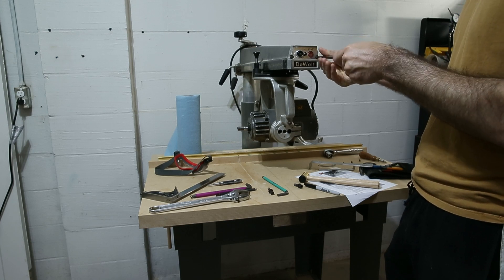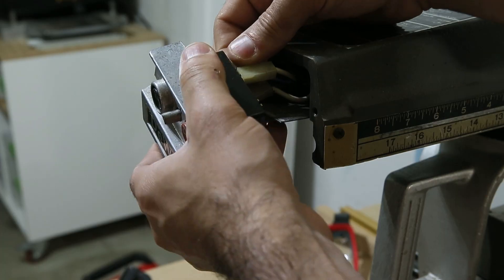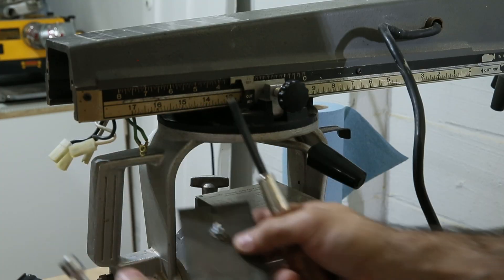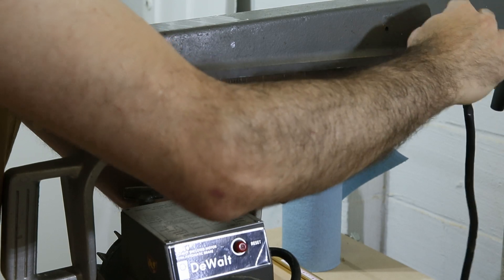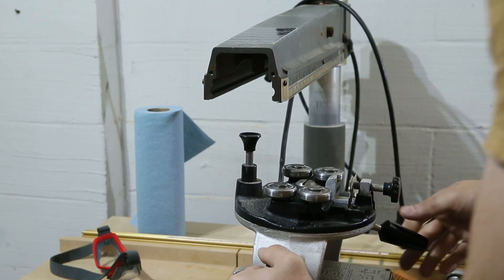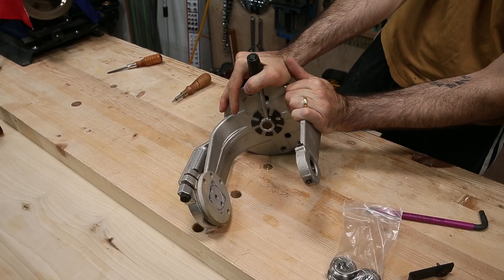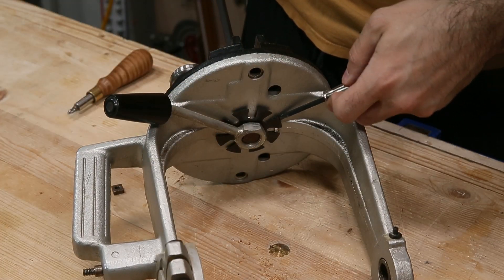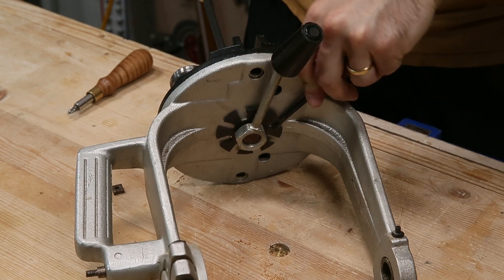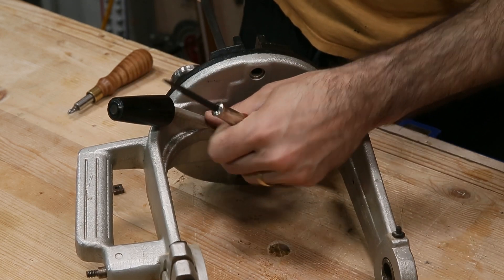It was now time to take it all apart. In a stroke of engineering genius the power switch plays double duty as the travel stop for the roller head, so the first step was removing it. The wiring looks like it's in pretty decent shape, although I will rewire this saw to use a modern magnetic switch in a future video. With the switch out of the way the roller head can just slide right out. At the bench I removed the hex bolts holding the motor to the yoke and set the motor aside. The bolt holding the yoke to the roller head — which is apparently called the king bolt — has an annoying star retention mechanism that you have to pry on in order to unscrew. On newer models that was replaced with a socket head cap screw you could just remove — definitely a big design improvement.